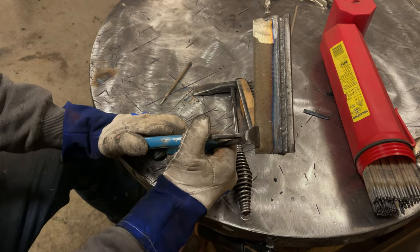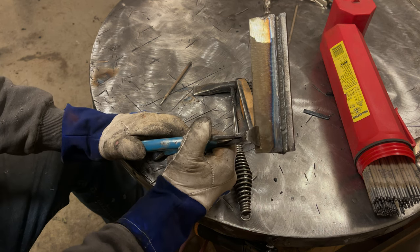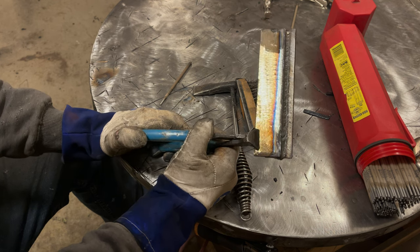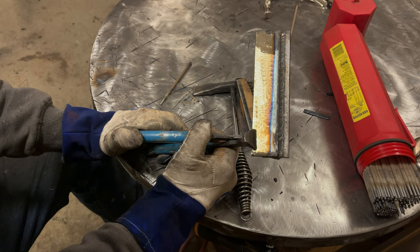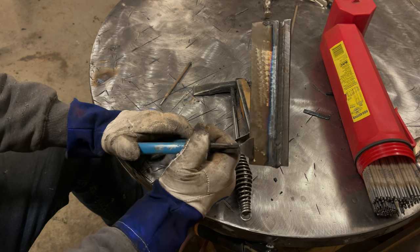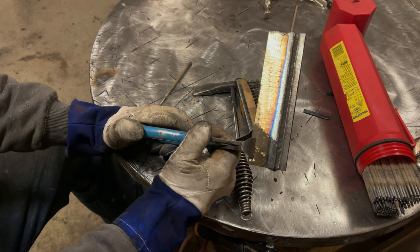I decided to start using a bucket just so that I could sort of put this video on fast forward. The water's kind of vaporizing off this. I want to talk about that a little bit. It's all right in training if you quench your piece in a bucket, that way you can run passes faster over it. That's okay, but never, under any circumstances, quench anything that you're working on.